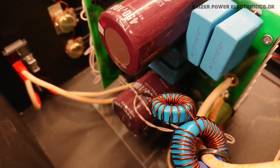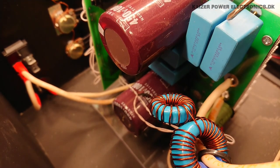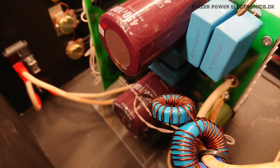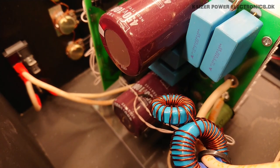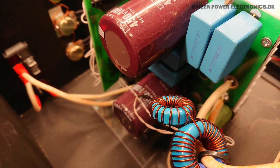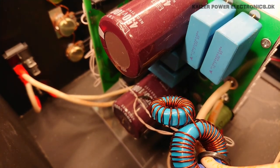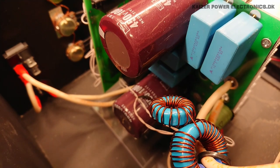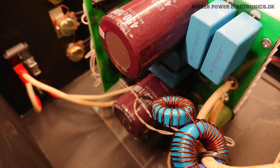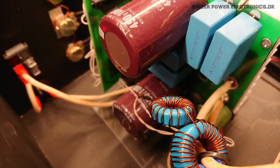And once we are also here, we can note that all the DC film capacitors, the blue here, are 1 microfarad, so they are not a resonant capacitor, so this is a regular solid-state Tesla coil and not a dual resonant. So this would not be able to play music that well unless we just use a regular audio interrupter instead of this. So it can be done, but as a really good one, like you can make some good long lightning bolts with a dual resonant, it's not going to happen with this one.